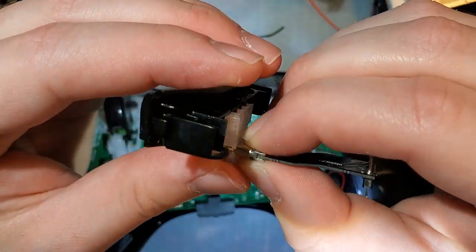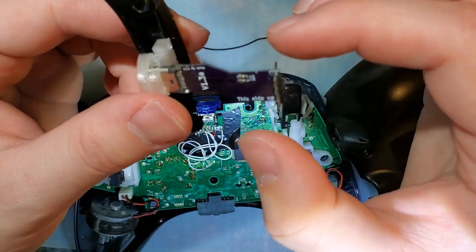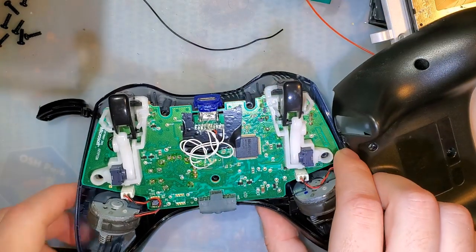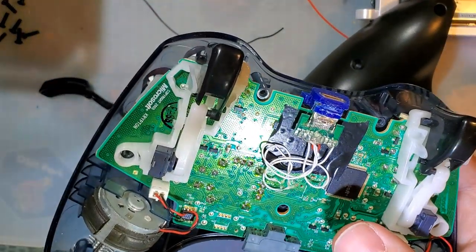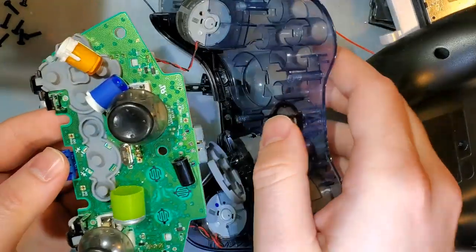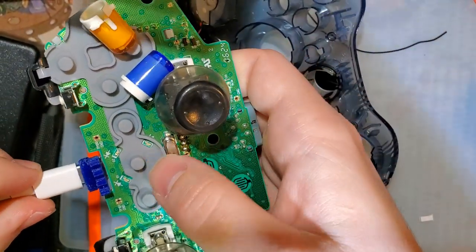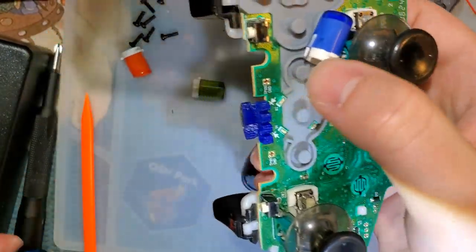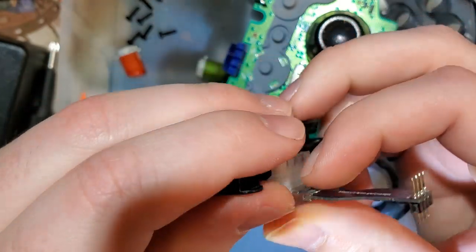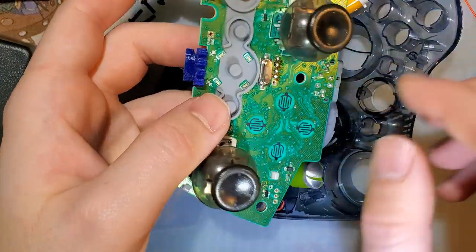But the thing is these ports just kind of straddle the edge of the board, and if you have something plugged in, there's a lot of torque on these solder joints, and it just doesn't work too well. This one, my prototype, actually doesn't work on a USB-C to USB-C connection here, because I never included the resistors. Ugh, the cable is just barely not long enough. But if you plug it in, you get nothing. But the PCB version, this one, does have the built-in resistor, so it'll work with a Type-C based host. Oh wait, that's what I want to put away. Okay. Anyway, I digress.